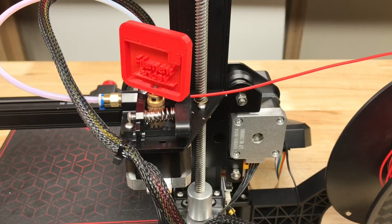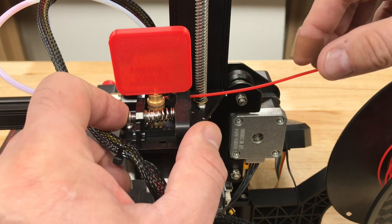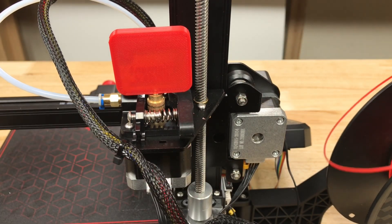Just a little bit is pushed out and now the filament will come easily out of the nozzle. After the 200 millimeters is unloaded you can manually move it the rest of the way — that's why I wish I could make the number bigger — but now you can just easily pull it out and there's no more filament in the printer.